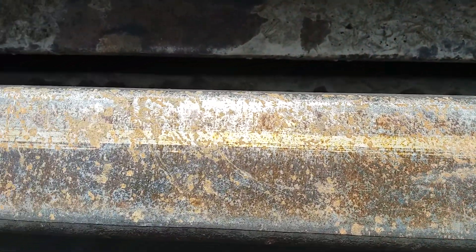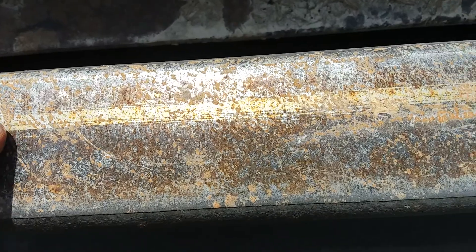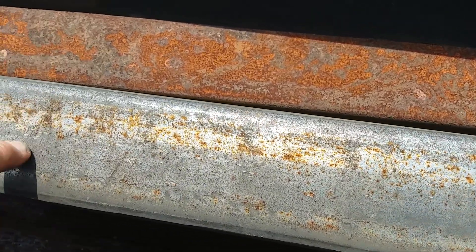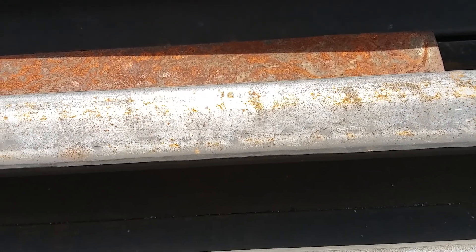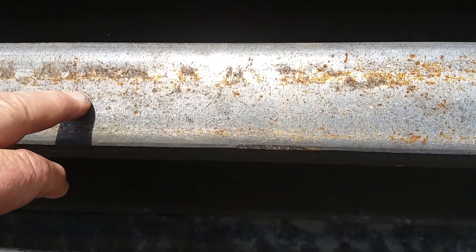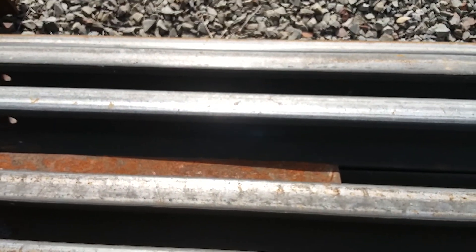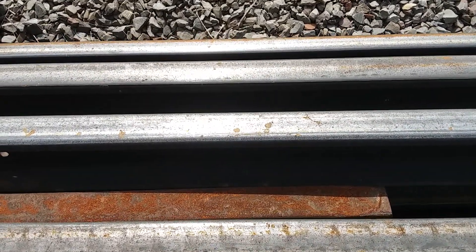Here's another good one. This band right through here — it's rough to my fingers, not smooth. Here's a pretty good example of the corrugation. It's a wave-like pattern that goes through there, and this is just beginning — not real bad yet, but obviously going to get a lot worse as traffic goes over it. Again, go back and watch that video and you'll understand. I don't know if you can see these little scratch marks in here — those are caused by that hopping and skipping too. You'll understand what I'm talking about, what that wheel is doing as it goes through that eight-degree curve.